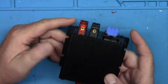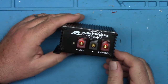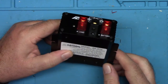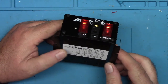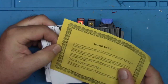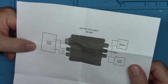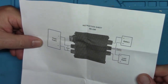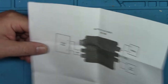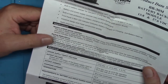This is an uninterruptible power supply — it will switch over automatically. Interestingly, it says it's made for SLA — sealed lead acid — batteries. I bought this and the listing didn't say LiFePO4 specifically, so I assumed it was LiFePO4 compatible. When I got it, the documentation — which is a one-pager along with a warranty card — shows the connections: the radio or load, a common negative between the two, the battery hookup on one side, and the power supply inputs on the other. It specifically says SLA.